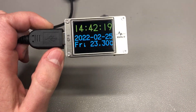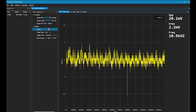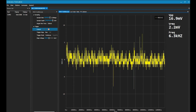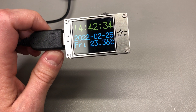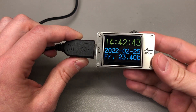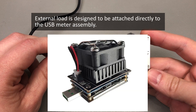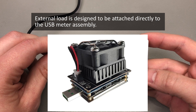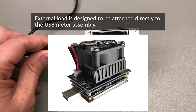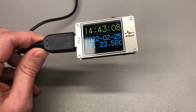There are two more interesting features. The first is a very nicely made and comprehensive PC app — we'll take a look at that later, but so far I have a feeling this is by far the best PC app from any Chinese supplied test instrument I've seen. The second interesting feature is that it supports Lua scripts, which can turn this into a fully automated test setup. There's also a companion optional external electronic load module which they claim is capable of up to 100 watts max, though I think it's only 65 watts continuously. I don't have that module but from other reviews it seems well built and does the job as advertised.